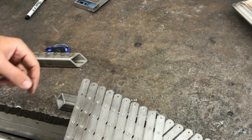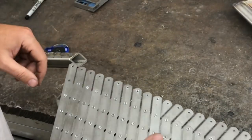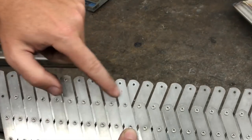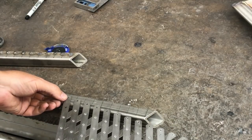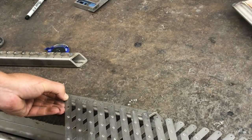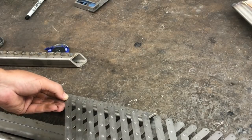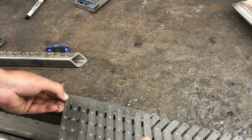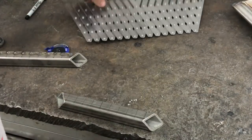So I'll use this rivet fan tool here. If you're interested in buying something like this, I'll have a link in the description to Amazon. You can see a little tick mark there — that represents 10 holes. You just spread this thing out, with the first hole there and the last hole at the end. I've already got this one marked, but I'm just showing you how it works. Spread it out to get it even — there's the 10. Then you put a little tick mark in each one with a fine point Sharpie and come back with your square and draw your lines.